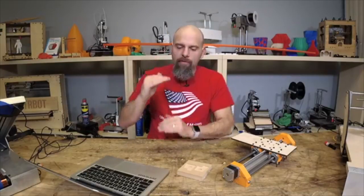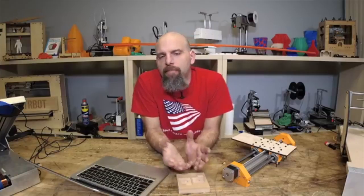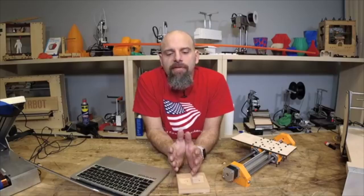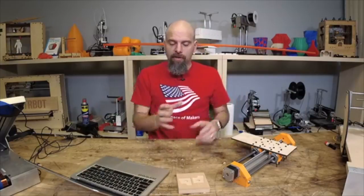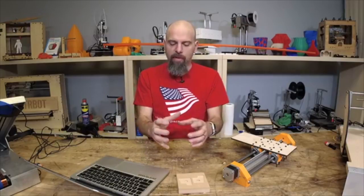max and min, on the E so it wouldn't destroy itself, when you print, it doesn't take very long to print with this because it comes out of a tip on the end. You can cut the tip to any size you want, and you just set it up in your slicer. When you extrude, I like to do spiral prints, or you can write words in frosting or something like that. But in fact, you don't want to home the printer before you start. You actually manually move it, or you can do it with your host interface, but I just manually move the printer where I want it to start.